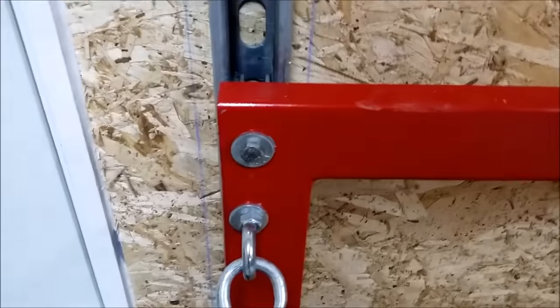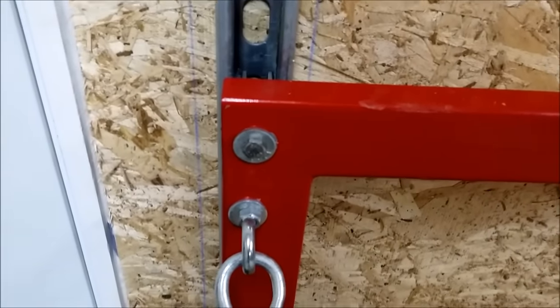With regard to the types of dollies that I use, these are just standard 1 and 5/8 inch dollies. You can get them on McMaster-Carr — I'll try to remember to post a link when I put the video together. Essentially they're roller bearings on either side and they bolt with one bolt directly onto the frame that I made for my lift.